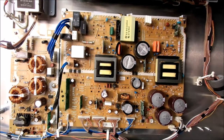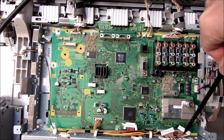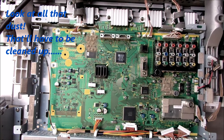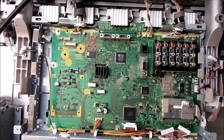Of course this is our power supply here. One way to test it - with both the ten flashing LEDs and also the two LED flashes - is to disconnect the power supply itself from the main board. So by isolating these three connectors here from the main board, that separates our power supply. So in theory now, if the power supply is okay, when I turn it on we should have a backlight as well as the TV should turn on independently.